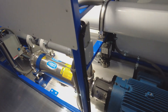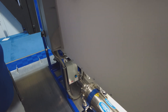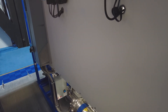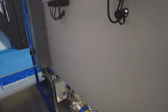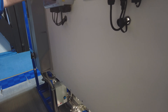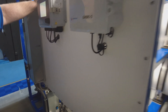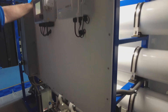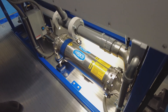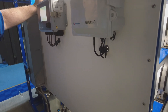Let's say the TDS is at 4,000 — after this process, what would the average result be? We would have it under 400. And if salinity is at 5,000, we'd have it under 300. We can take it all the way out, but then we have to re-engineer the water for the pool because the water would become too aggressive.